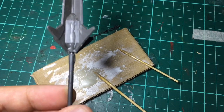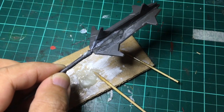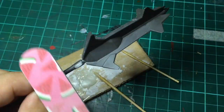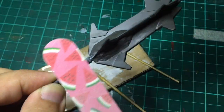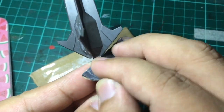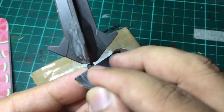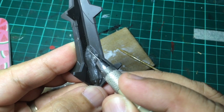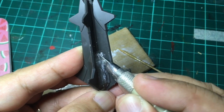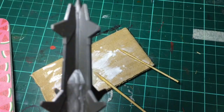Here's the super glue and baby powder mixture already dry on the gap that we're filling in. As you can see, I'm already beginning to sand it — this is slightly easier to sand than just super glue alone. The hardness is quite similar to that of plain plastic. You can scrape it and it will easily come off, and you can sand it and work it as if it was bare plastic.